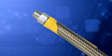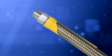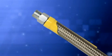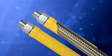TNS gas hoses begin with a hydroformed inner core, which provides both strength and flexibility. The core is covered with a high-quality stainless steel braiding, and then with a thick extruded coating for added cleanliness.